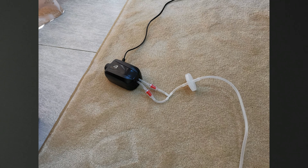This spindle has an air inlet to allow flooding it with protective air. I feed it with an aquarium air pump which is much quieter than the spindle running noise. I added a HEPA sanitary air filter. These filters claim to filter to below 1 micron, but I have no way to actually test that claim. However, anything that I can do in order to avoid dust from the air being blown into the spindle bearings is probably worth the effort.